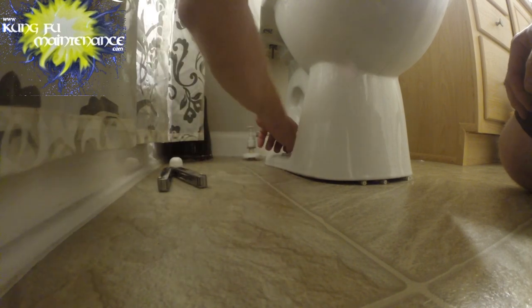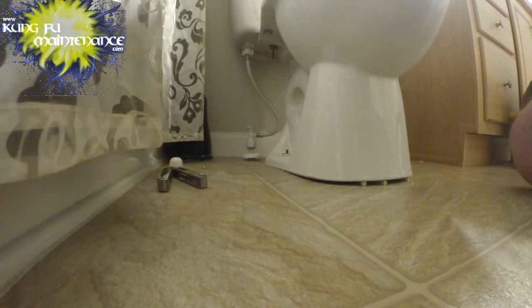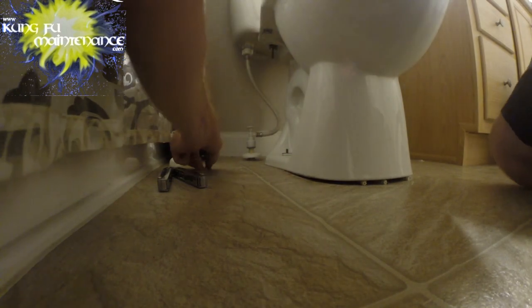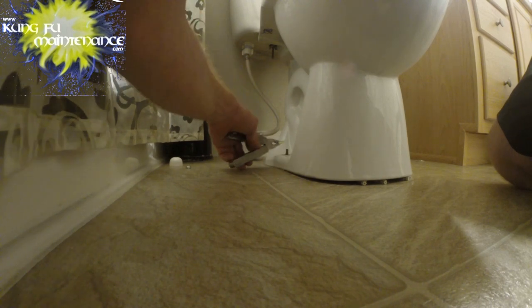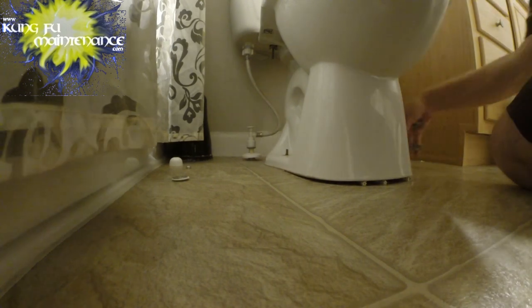So these bolts, if you're going to trim your bolts, you always have to put the nut on the bolt first, and then cut it with a hacksaw or whatnot. Then when you unthread the nut, it'll straighten out the threads, so it won't cause you trouble.